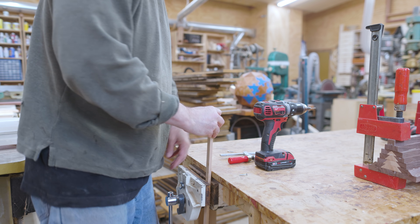Clamping the 45-degree angle wasn't too difficult. I used the wide part of the clamps to hold the joint vertically, then smaller clamps to pull the sides together. The bigger clamps keep the joint from coming apart since the force from the smaller clamps is all at 45 degrees to the seam — clamps vertically and clamps horizontally. I got the four sections for the tree glued up and realized I needed more walnut, mostly for the very top piece and the base below the tree.